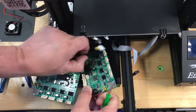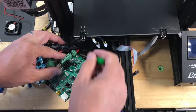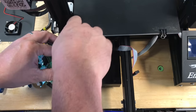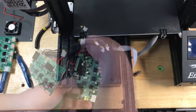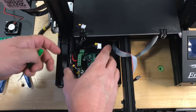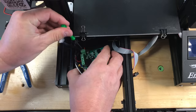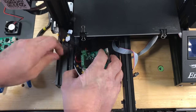The final two connections on the original board are the power connections at the back. They're really hard to get to but I'm going to do them both at the same time. I know black is on the left and red is on the right, and I was able to slide the new board right in because the wires were held in place. I just pushed the board in, the wires lined right up, and all I had to do was push the board back and tighten the screws. I could see the wires were going deep into the terminal block — no shorts, everything was good.